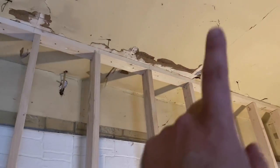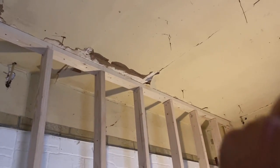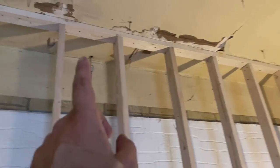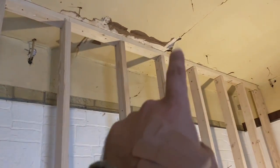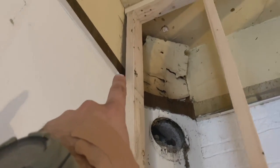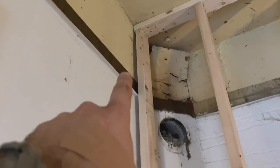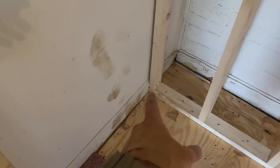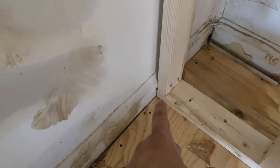If you need to go up there, remember, put some blocks in there. Your ceiling joists, let's say, are running this way. Just put a block in right here, right where that wall is, all the way down, and you can nail your wall into that. Okay, and over here, I left the metal from the old drop-down ceiling. You'll see why if you follow me into episode 3. I'm doing another video right now currently. Down here, you'll see what I do in episode 3.